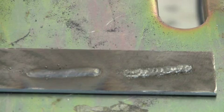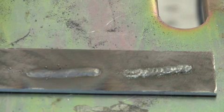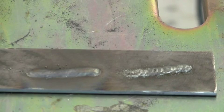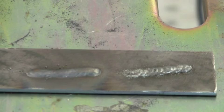What the gas does when you turn it on is it helps to transfer the heat of the arc all the way down to the metal. If there's no gas, there's not a lot of heat transfer. You can see on the left piece that the metal is blue — it's got good blueing, which means that good heat has been put into the metal, whereas on the right side you don't really see that.